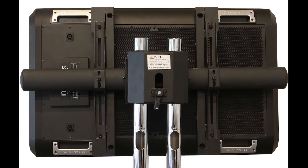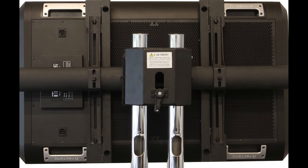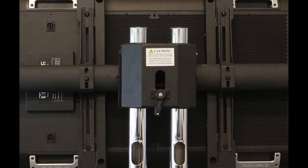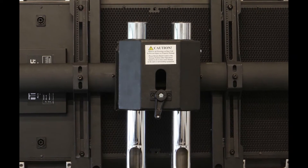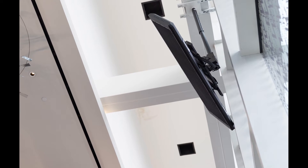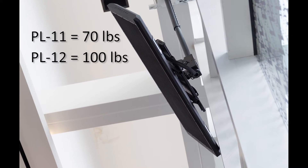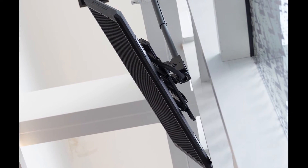Tectonic speakers look a lot like flat-panel TVs and can use the same commercial-grade mounting hardware. The standard mount for flat-panel TVs is the VESA mount. VESA stands for Video Electronics Standards Association and is a technical standard for computer displays. When selecting VESA mount hardware, make sure that it meets the load ratings for attaching PL series speakers. Select the mount that is rated for at least these weights.